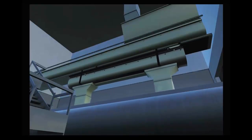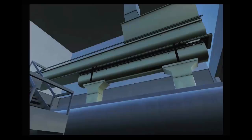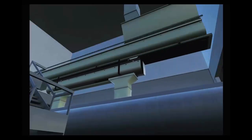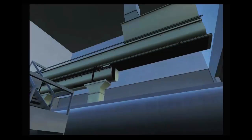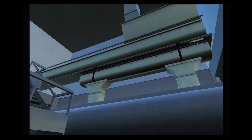The shuttle conveyor has a discharge on each end and rides on rails so that a discharge can be positioned over any chosen truck compartment. The benefit of this system is that the loading happens online and does not require much downtime between feed compartments, as is the case with the weigh lorry.